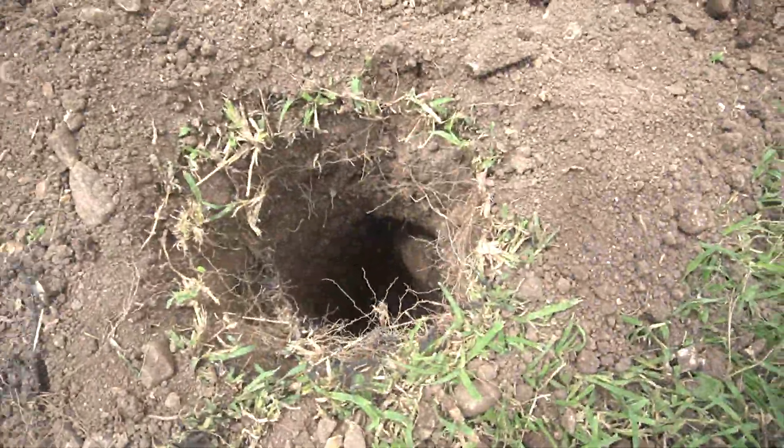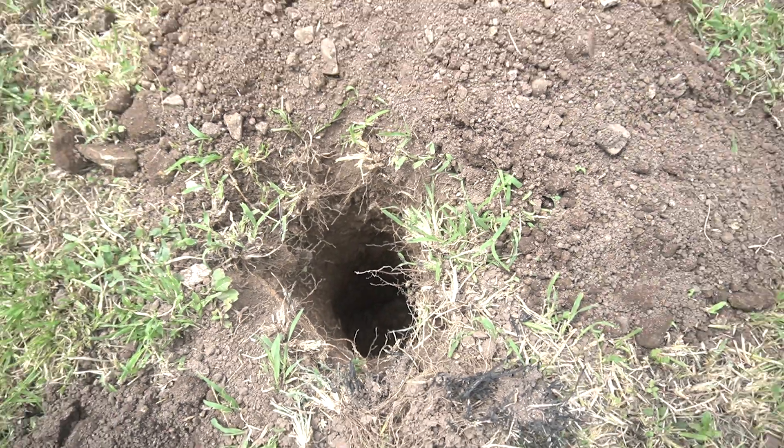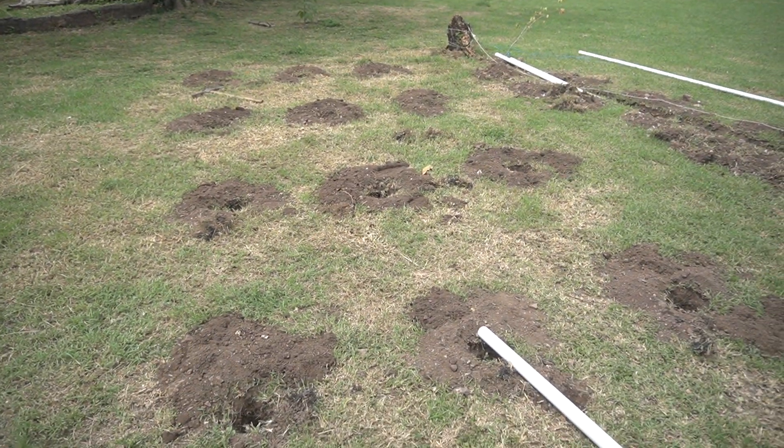Welcome back — it's a totally new day. We have these holes dug, approximately two feet deep, and there are 12 of them. We're going to have galvanized poles planted in these holes and then the solar panels will be mounted on top of these poles. They're going to be planted with concrete and steel, properly reinforced, so that in the event of heavy downpour, heavy wind, or a hurricane, these panels won't move. They'll just stay there.